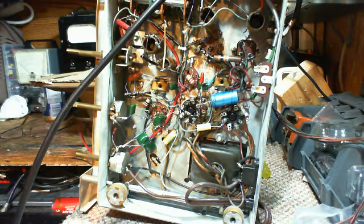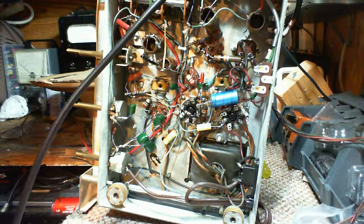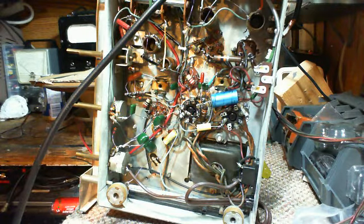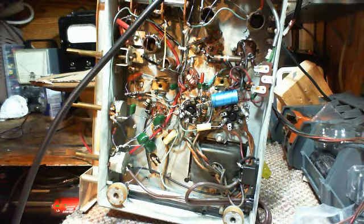Boy, that's really interesting. My high hydro voltage in Ontario, and maybe most of Canada, we tend to call a power company a hydro company, since originally the electricity was generated using hydroelectric power. So that's what I mean when I say hydro. I just really mean the power coming to the house. My supply voltage is 123 normally, sometimes even a little higher. And that's actually out of range. I think the official standard is 120 at the top. So the utility, should it become aware of this voltage, would be compelled to take action to drop it.